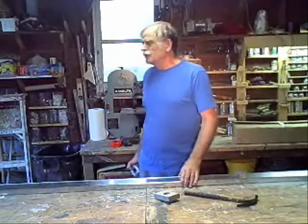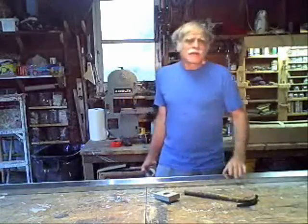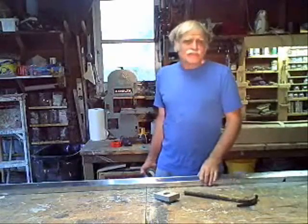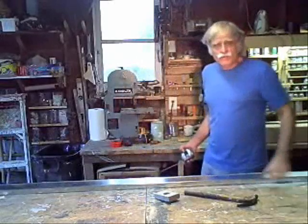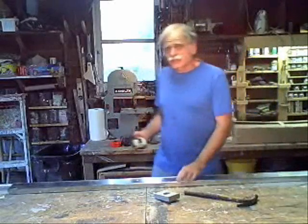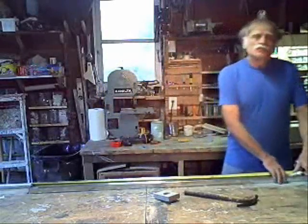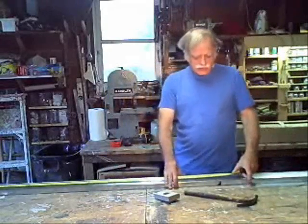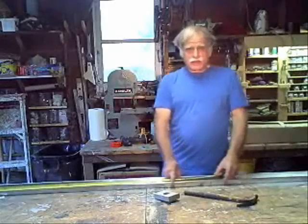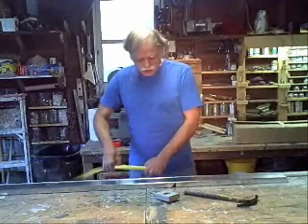To make maximum use of your construction materials, do the bend on the collector at 8 feet 2 inches, which is 98 inches. Measure from the end of the steel stud slot — use the end here. This is the bottom of the collector, so we measure to the end, 98 inches, and it's right here. So what we're going to do at this point is mark it.